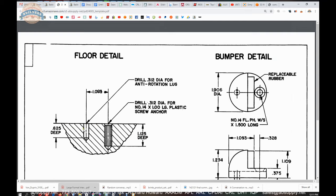The anti-rotation hole is the shorter one — they say 5/8 inch deep. That's wrong; that's way off. That hole needs to be one inch deep because I'm measuring it here in my hand and looking at the pin at 5/8 and saying that's not right. Nothing on here is 5/8 inch. You're going to be every bit of about one inch deep on both holes, would be my guess.